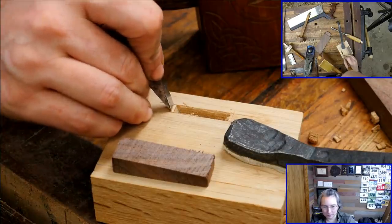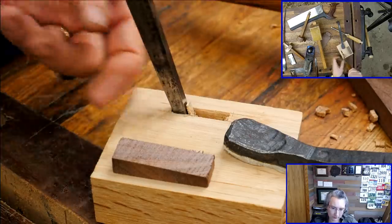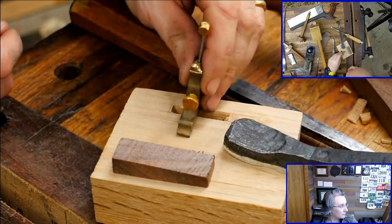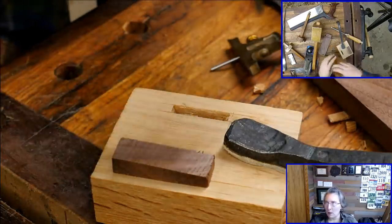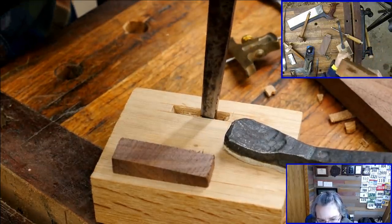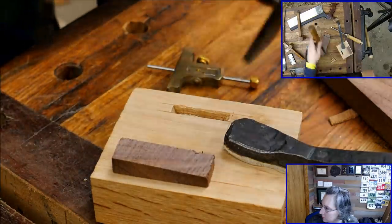Getting close to the other side, I want to stay away from that line because when I go all the way down and pull out, I'm leveraging against this point and I don't want to crush those fibers back against the line. Leaving that little bit of material gives me something to leverage against. Checking depth — we're getting close, about a sixteenth inch away. Now rather than going this way, I'm going to turn the chisel around and start working in the opposite direction to take it down a little deeper. In the next pass we'll be at depth — just scratching the bottom of that — and from here on out I'm just making sure I stay at that depth.